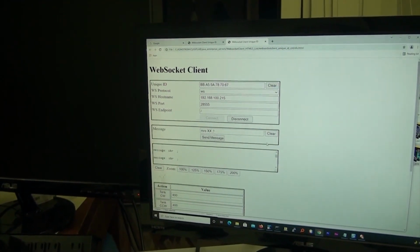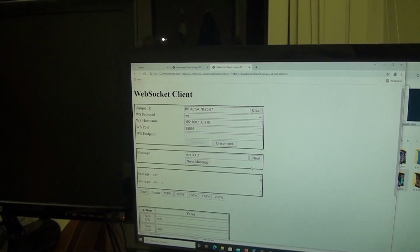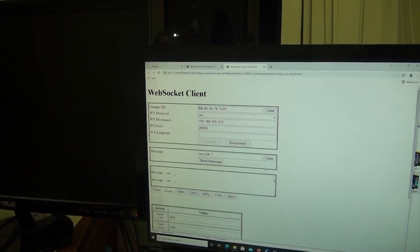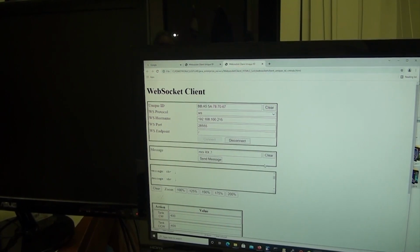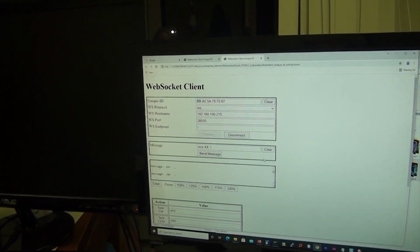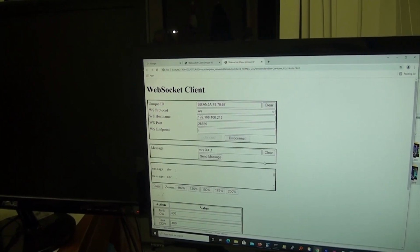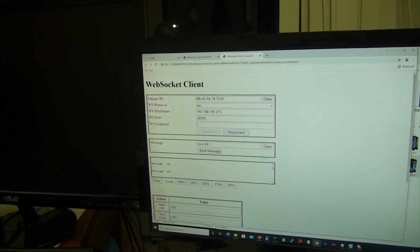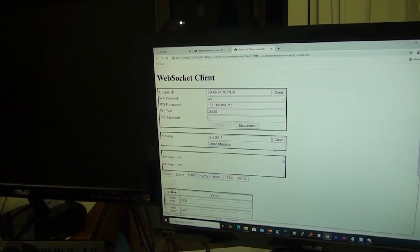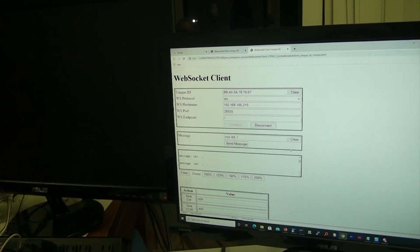Okay, so this is very powerful. Again, this client here illustrates that we have a WebSocket API into our network of robots, and that WebSocket server does the heavy lifting in terms of all the routing. We have special code in the remote robot control program or command program, RRCP, which is unique, which makes sure that commands only go to that rover and responses come back only from that particular robot back to the initiating WebSocket client through the API.